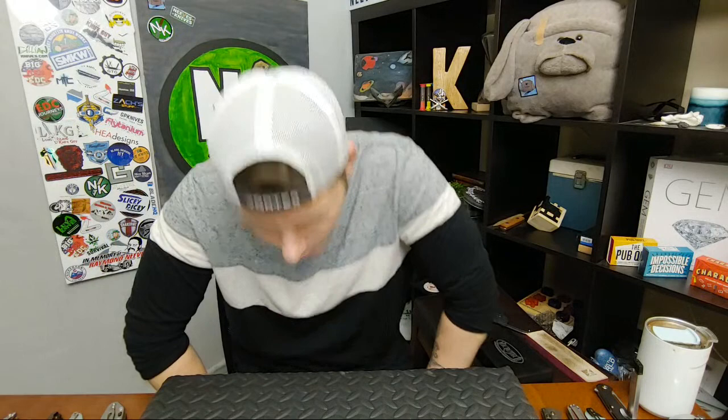Alright, okay, it's sharp, but the second tip isn't as sharp. Yeah, just do it again. Go back to your low grit and get it sharp from your first stone. Don't mess around with any other stone. Forget about the other stones. Your first grit, that's the only grit that matters. If it ain't sharp from the first stone, it's not going to be sharp off of any other stone. So if you have a 300 grit stone and it's not crazy sharp from that 300, then 600 ain't going to do you any good.